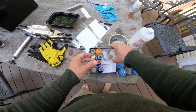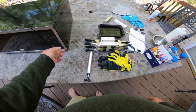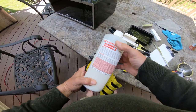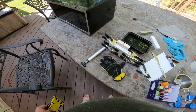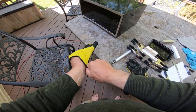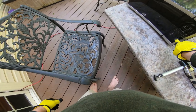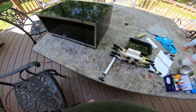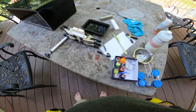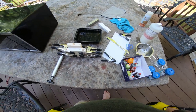You just need some molds and a microwave — and you don't want to use your household microwave because it's not good for it. Before you pour plastisol, if it's brand new out of the container, you need to get it over 350 degrees at least once in order to pour it. Once it's been over 350 degrees it's converted, so you can use it at lower temps — 320, 330. I usually like to pour it around 350. I don't have air removal devices or depressurizers or pressure cookers, I just do it basic. I don't worry about air bubbles — if something doesn't turn out right I just throw it back in the pot, remelt it, and try again.